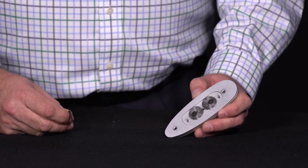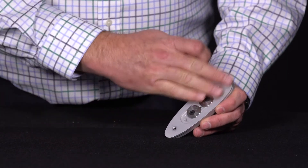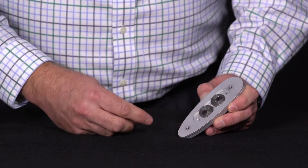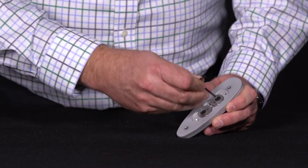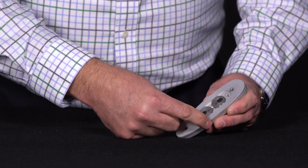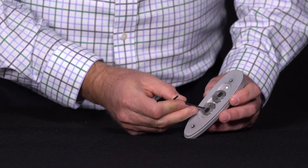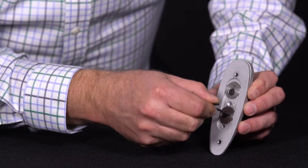For convenience, we're going to demonstrate the adjustments on a pad plate off of the shotgun. When you get the recoil pad off, you can see there's two eccentric cams that are in a slot. To make fine adjustments, you loosen the two cap screws. That enables the pad plate to slide up and down. There are two holes in the eccentric cams — you can put the Allen wrench in and turn them for fine adjustments.